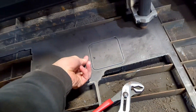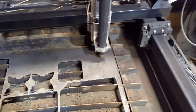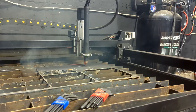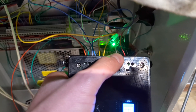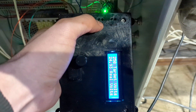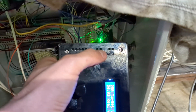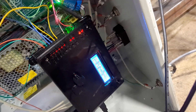The cuts are fine, but the THC isn't doing anything. I tried a bunch of different things like readjusting the THC settings, cutting at a lower speed, and cutting thicker material, and nothing... Wait, guys, I think I figured it out. I was flipping around some of these wires, and I forgot to have the power wire on pin four — the ground goes on pin three. If it's polarized, that would make exact sense as to why it's maxing out the voltage right away, because it's basically like infinite — going to infinity, which is 250 in this case. So if I flip those back, it should allow everything to go through.